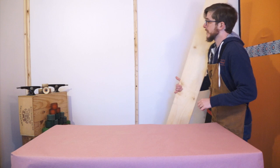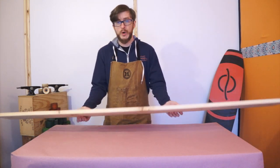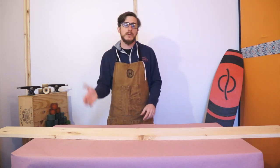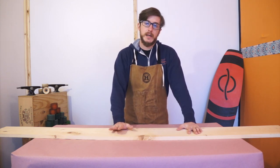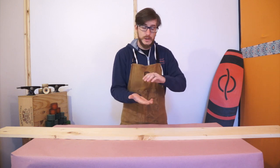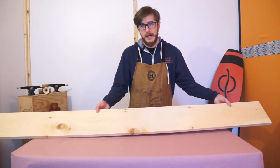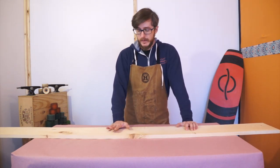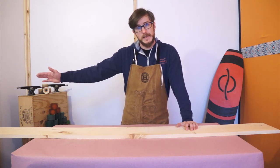Let's take a quick look at materials and tools. The first thing you're going to need is some wood to back the molds on. The foam itself is not going to be rigid enough to take any kind of clamping force, so we've got to make sure that there's something rigid on the back in order to distribute that force and push our veneers into shape. The most cost-effective way of doing that is just with some pine — it's super cheap from any home goods store. You want to have a board for the male and female halves of the mold.